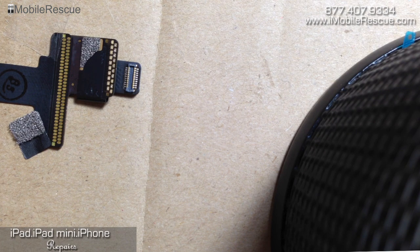Hey, what's happening, folks? Ryan from iMobileRescue here. I want to do another video on soldering the iPad Mini digitizer to the IC chip on the first generation iPad Mini. I want to make this video to show the solder job with flux, done in the more advanced way we've learned — not taking 40 minutes without flux. For those of you who are advanced in soldering or want a better way, flux is much more facilitative for the flow of solder.